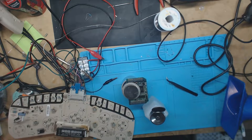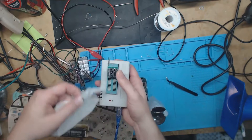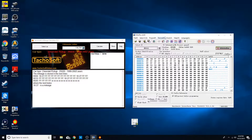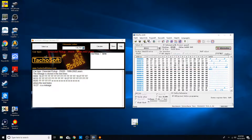Then we'll put it in the chip reader — you've all probably seen my rig. It's just this guy right here — you just drop it in, it's a little socket. Here we have it in the prom reader, the mini pro. I went ahead and just did a device read — I'll go ahead and run that again. Finished read, and we get the same read.